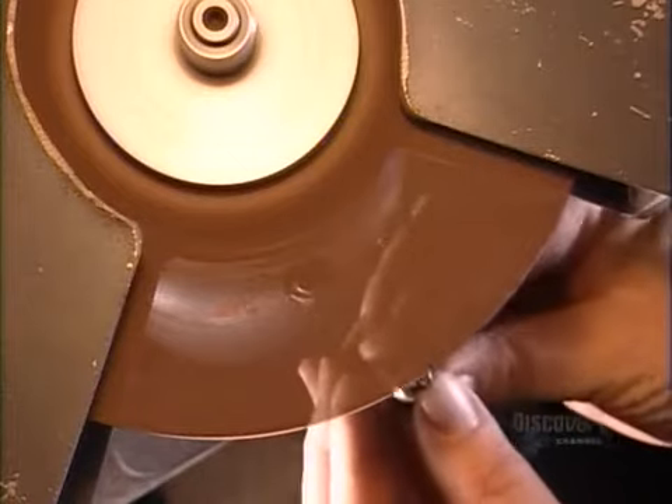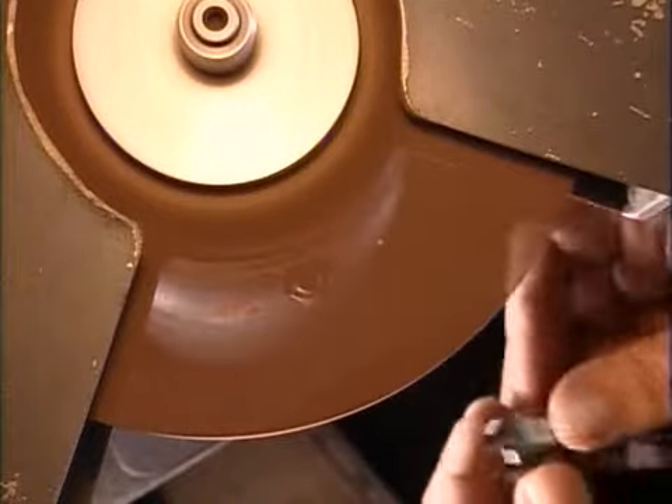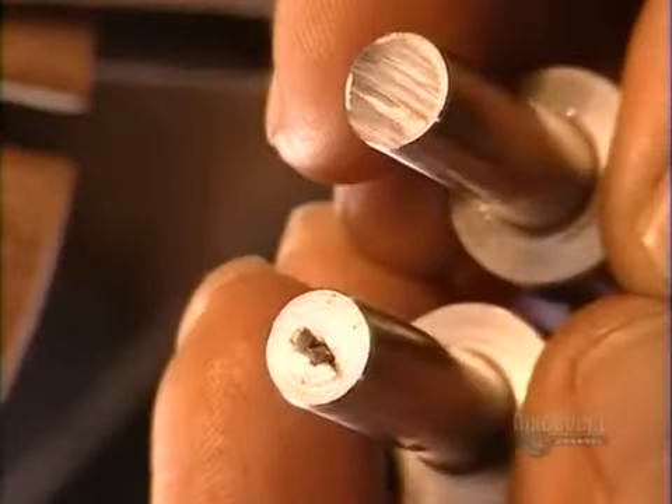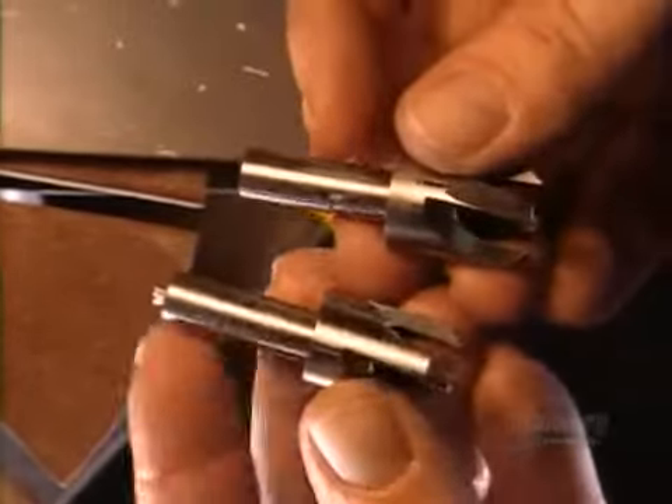Now for some manual touch-ups. First they grind the plug cutter against an abrasive wheel to remove excess metal from the cut-off. Then they do what's called side chipping — grinding the sides of each blade to a particular shape that'll clear the wood chips. Here's how the plug cutter looks before and after grinding off the excess, and before and after side chipping.